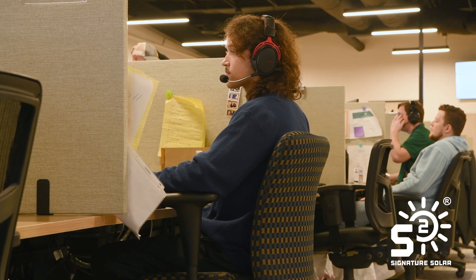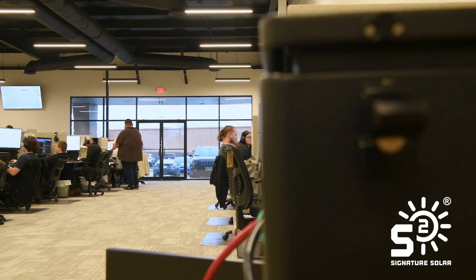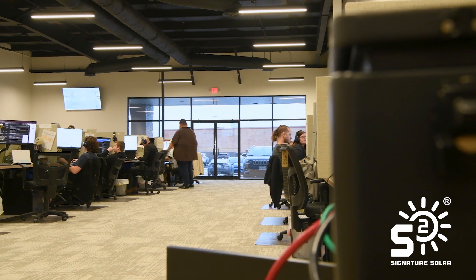My name is Ethan. I'm a tech support associate here at Signature Solar, where we have a dedicated team of technicians who are happy to help. About a week or two ago, I spoke with a couple who had about five of our 6.5 kilowatt inverters and they were seeing F90 errors across the board on all of them. After speaking with them and getting some photos to look over, we came to the conclusion that the communication cable between the inverters was a third-party cable that was not compatible with our inverters — it was basically transferring the F90 fault to the other units.